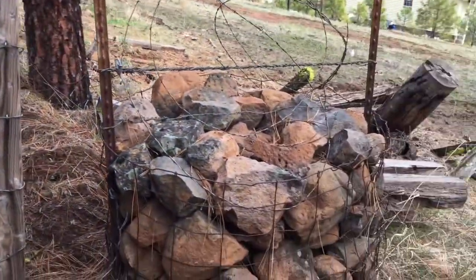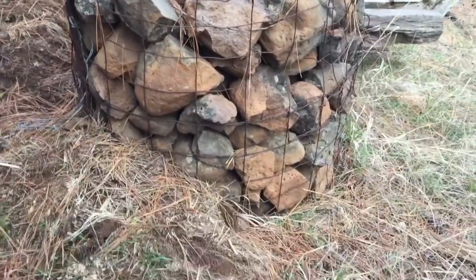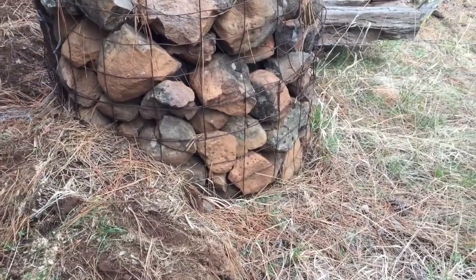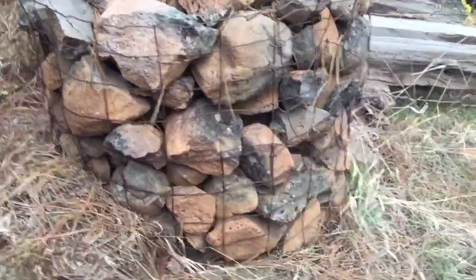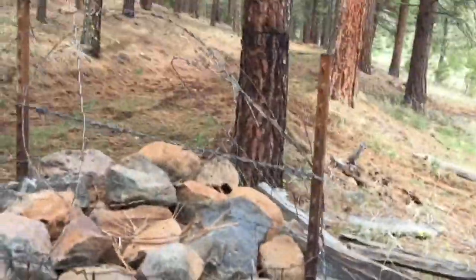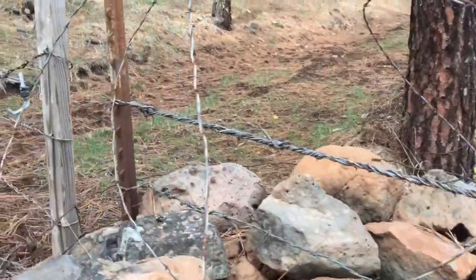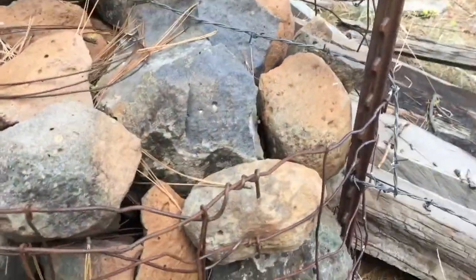What they've done is driven in two metal stakes. There's not a lot of depth of topsoil here — apparently you dig down a bit and it's hard pan, so it's really hard to get enough depth to put a big corner post. So they drive in a couple of metal posts and then wire them — you can see here they've used barbed wire and crimped those two posts together.